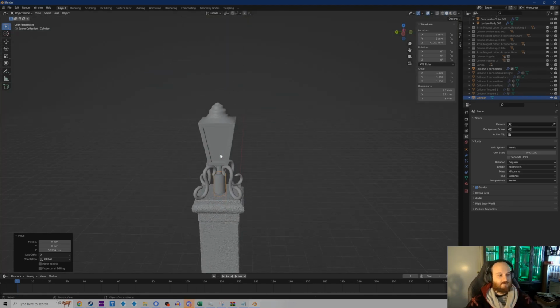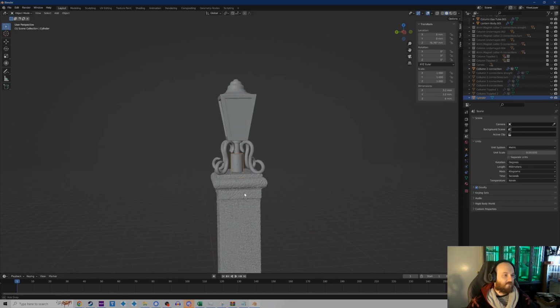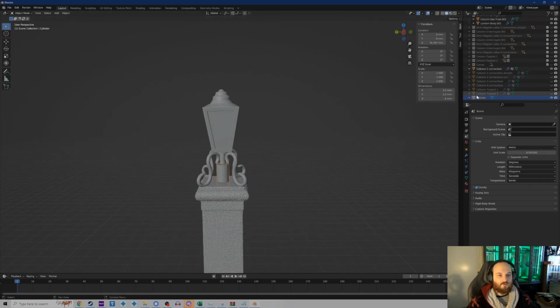But we then need some clearance at the bottom of that hole so that when this presses in, it can actually go all the way down, because we want it to be resting into these grooves here. So we're going to take another 0.5 mil off that. Let's go to Z and go minus 0.5 millimeters. That'll be now dropped down just that little bit more, and we can now subtract that.